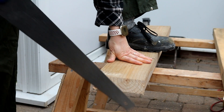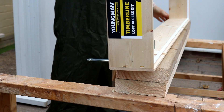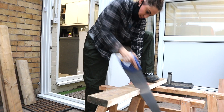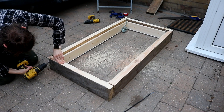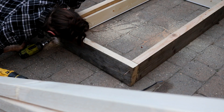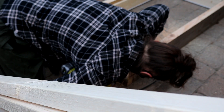For the other two shorter sides to go width ways, I needed the length of the two thicknesses put together, including the width of the box. That's why I had them stacked up on top of each other to measure them and get the final length. Once all my cuts were done, I positioned them around the loft hatch and pre-drilled and screwed them together with four-inch screws.